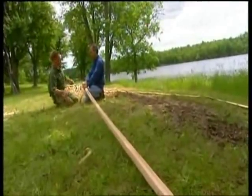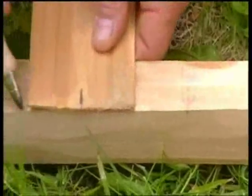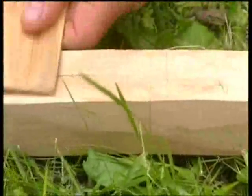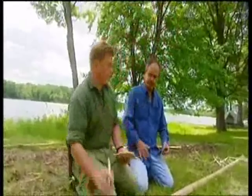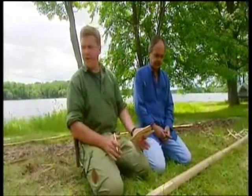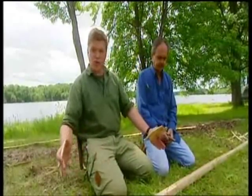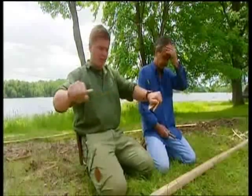No tape measures, remember, so we used a template to mark up where the ribs should go. Whilst that may seem straightforward enough, you need to know what you're doing. It's really interesting. Although we're very early on in the building stage of the canoe, we're having to make important decisions right now. The spacing of the ribs essentially determines where the thwarts go. The thwarts are the pieces of wood which spread the canoe above the top.